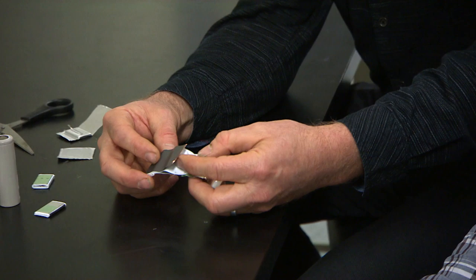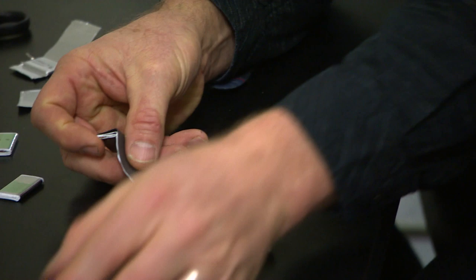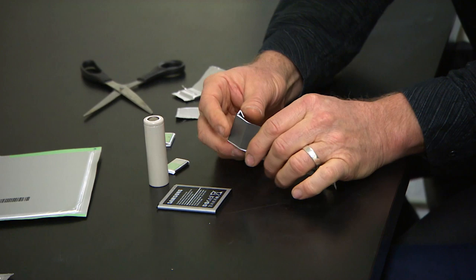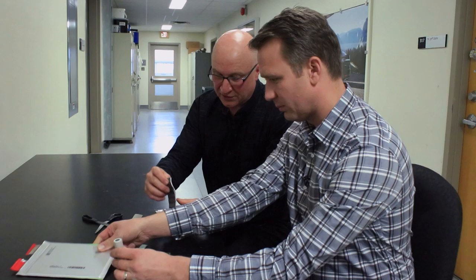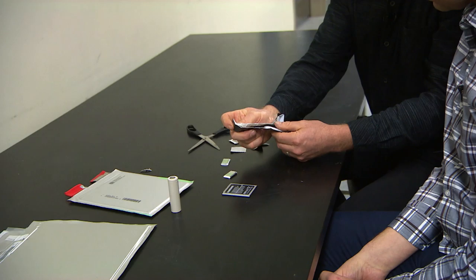And then we have the graphite electrode, which is graphite powder on a copper foil current collector, and then these layers are just rolled and rolled. If you compare it to a cell phone battery, it's just wider electrodes rolled on a wider roll pattern. A cylindrical cell is wound on a small cylinder at the beginning, and as it spirals out you get a cylinder. All lithium-ion cells in the world have these four layers: negative, separator, positive, and separator. Pretty simple.